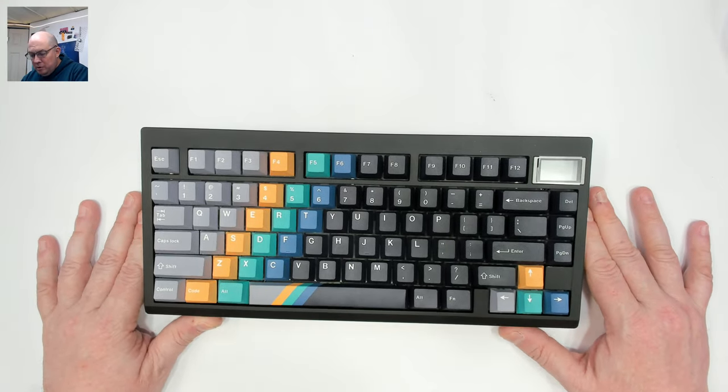So anyway, one thing, if this is one of your first mechanical keyboards that you're building from a kit, and you don't have experience with doing switches in hot swap sockets, then at that point I would honestly suggest that you carefully disconnect both of these cables and install your switches that way the first time. Not every time you install switches, but the first time. So not only can you support the back of the PCB, but you can also see, because you're going to be able to put it up to eye angle without the case getting in the way, and see the angle at which the switches are in, because they have to be flat. The top housing basically has to be flat all the way around on the plate. If not, it's not properly in, so that means it's probably not going to get a proper connection.